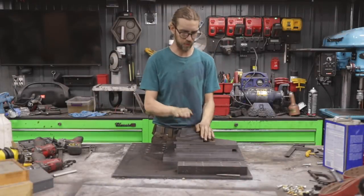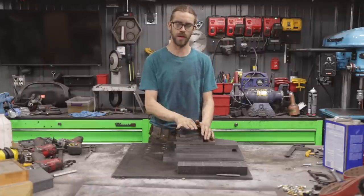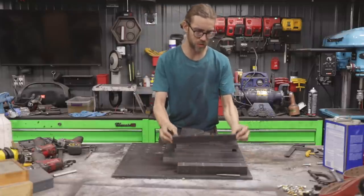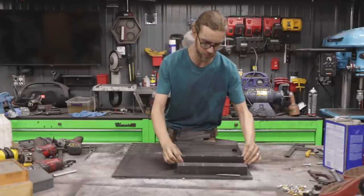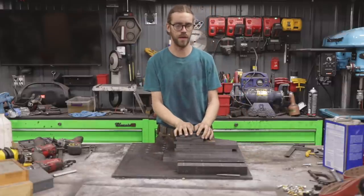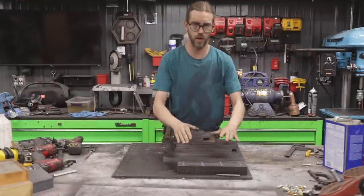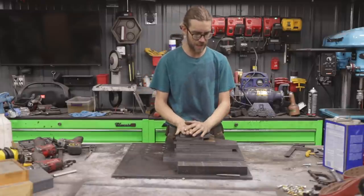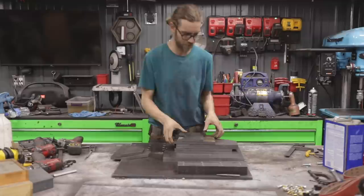All right, we got the plate cut, and I just want to talk about some design changes we've made since we started the process. As you've already seen, we switched to a different design for the four-part receiver. We're using these standoffs, makes things a lot more accurate. The difficulty was grinding all these straight, but as you've seen, we were able to get that within a really tight tolerance. For the next step, I went ahead and cut all this plate and dimensioned it on the grinder.